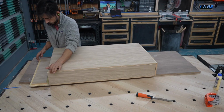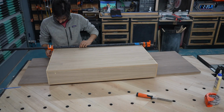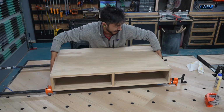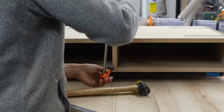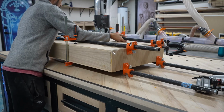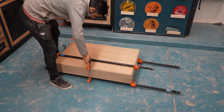The width of the bottom panel is really what's driving the final angle of the waterfall edges after I clamp everything up, so having the cuts slightly larger than 45 degrees won't create an issue in this case. Another nice thing to have, or really an essential thing for a glue up like this, is some nice long pipe clamps. This desk ended up being wider than any of the parallel clamps I owned.